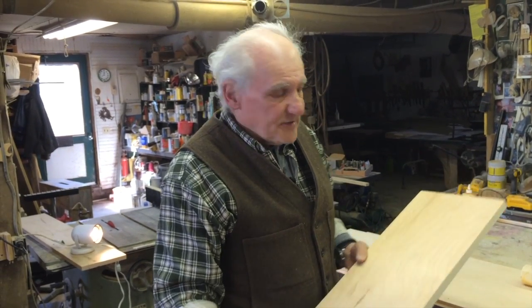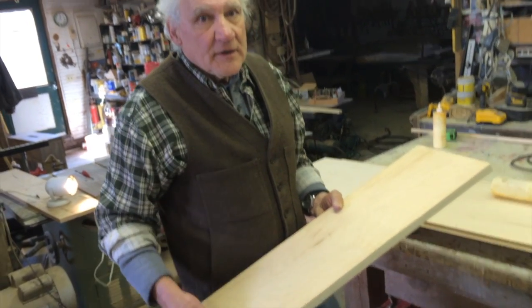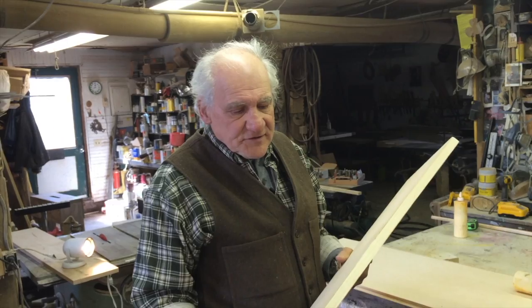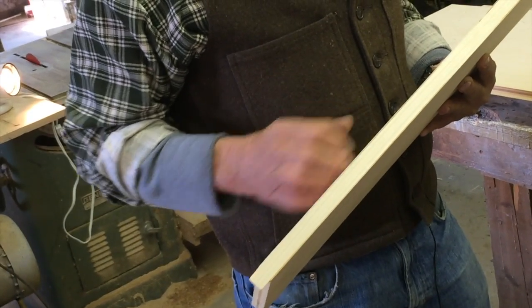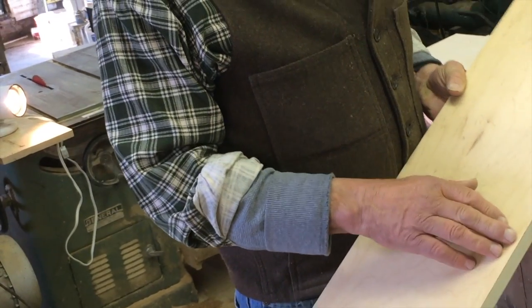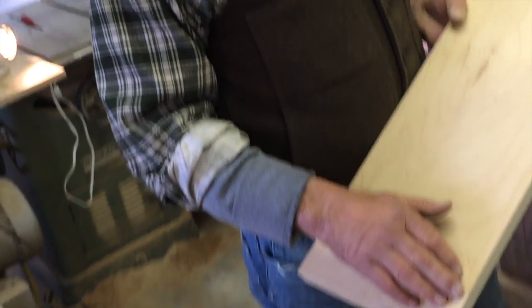When the glue has set, all you need to do is to set your table saw at the original setting you used to create the piece you wanted to edge band. Rip off the excess infill right up to the veneers of the plywood. It's that simple. You've now created the beautiful and durable Burgess Edge. As you can see, the seam line is right on the corner and is not visible. There is no seam on the face of the plywood like in most other edge banding systems.